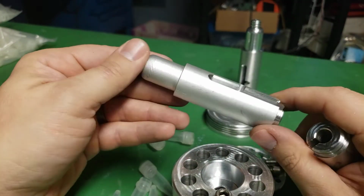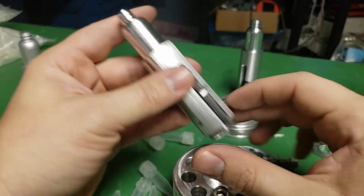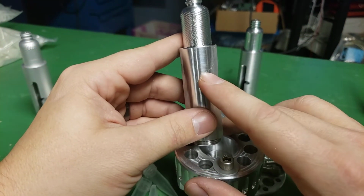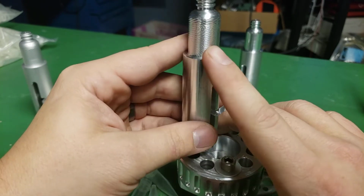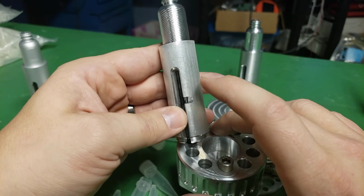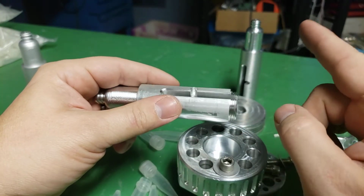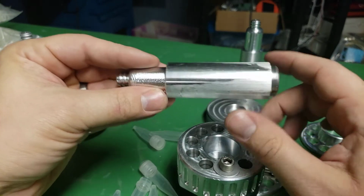So that's a standard practice that I do a lot when I have multiple operations for the same part, is I will keep any ones that I make in the first operation or subsequent operations that aren't quite as good. And then I just use those as my first trials for the next operations. That way, if I mess anything up, it's a part that's probably scrap anyway.